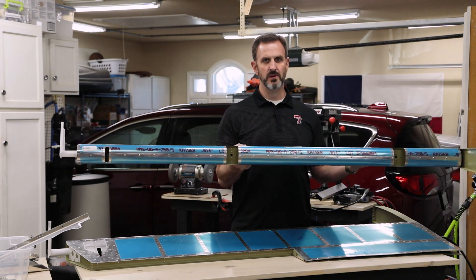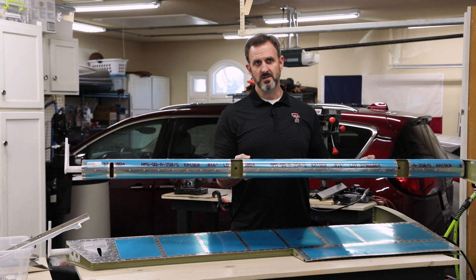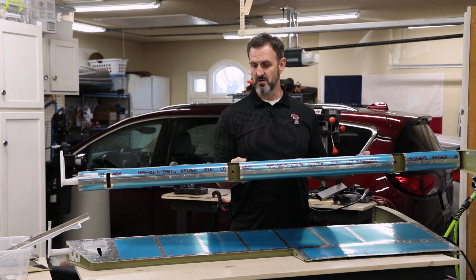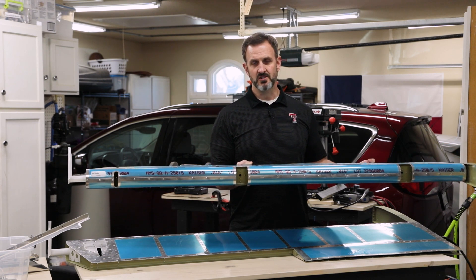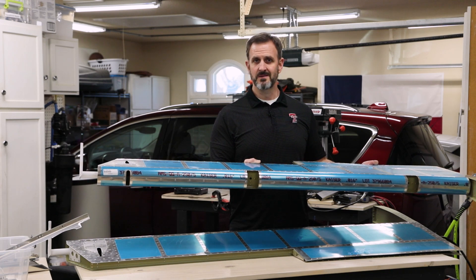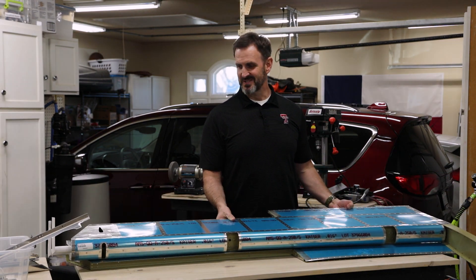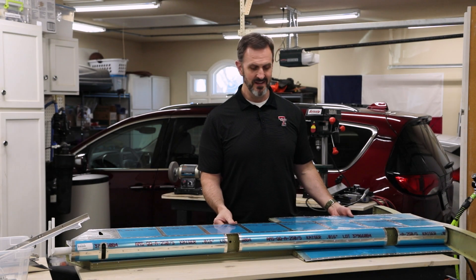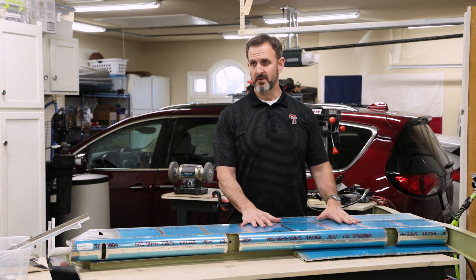In any case, this turned out really, really nice. I learned a lot more about riveting on this. It turns out on my rivet gun the PSI was a little too high. When I did these, I turned the pressure down quite a bit using a regulator and the results are a lot better. Now I look at the horizontal stabilizer and think it looks a little more beat up than I'd like, so maybe I'll rebuild that. Regardless, I'm done with the elevators for now and I'm going to move on to building the tail cone. That'll be next video.